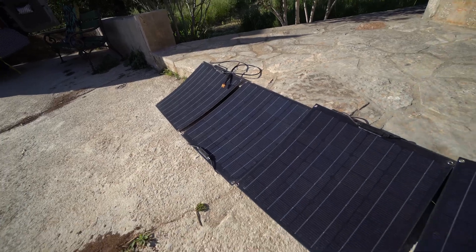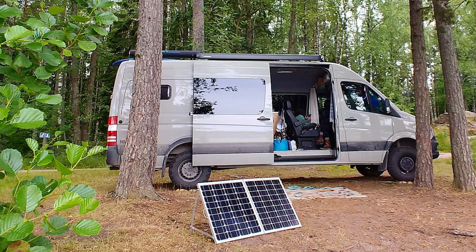Over time one of those 50-watt panels failed, so I recently upgraded. Instead of two 50-watt rigid panels, I purchased four 50-watt semi-flexible panels. My experience with semi-flexible panels is that if you permanently mount them on the roof without cooling underneath, they tend to fail within a few weeks. But as a portable setup that isn't used full time — and with 360 watts already on the roof, we'll rarely need these 200 watts of semi-flexibles — it's perfectly fine. What's nice about portable panels is that on a really hot day you can park in the shade, run a long heavy-gauge wire to the van to minimize voltage loss, and still get solar charge while staying cool. In winter or on overcast rainy days you can deploy them for additional battery charge.